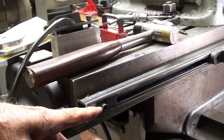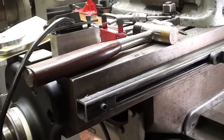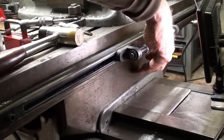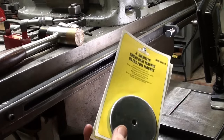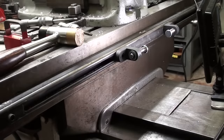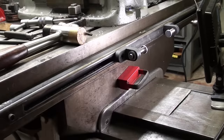The rail is securely fastened with two cap screws. I'd like to exchange these for button head cap screws — they would look better and there's less chance of hitting your knuckles on them. But now comes the hard part: how am I going to drill and tap holes into here for the actual switch and spacer? I've been thinking it sure would be nice if I could use some magnets. These magnets hold a 3-inch diameter and they're 95 pounds, but I don't have enough space — I've got about 2½ inches and these are 3-inch magnets.